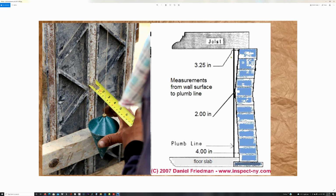But the plumb line is still used now in dams where they want to measure tiny movements in the dam wall in case there's a problem. They hang a plumb line. They also use electronic measuring devices, but a plumb line, again, doesn't need to be calibrated. It doesn't run out of batteries. If you want to measure a wall, but there's a deformity in the wall, they'll still use plumb lines.